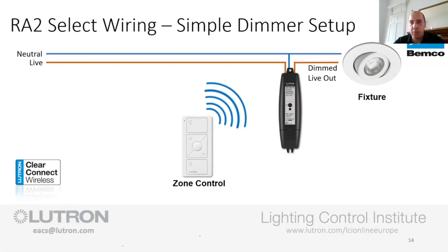you need to be cautious with the amount of LEDs that you're sticking on. I came across that on the hydro when they were looking at fixtures. The fixtures were quite high wattage, 280 watts, and it was a 10 amp type C breaker that we had in there, and they limited it to five fixtures. So that's only a 5 amp running current, and they limited it to 5 amps, or else it would trip the breaker. You do have some people that jump it up to a type D, which I think's a bit wrong, to be honest.